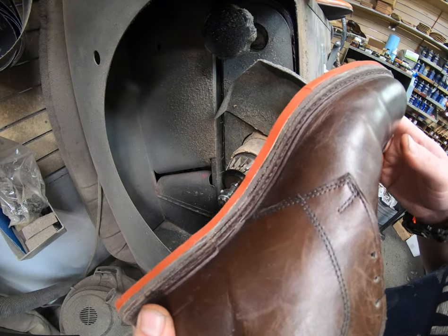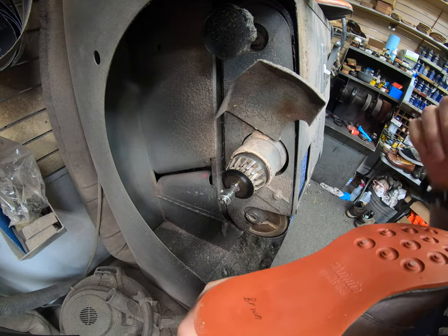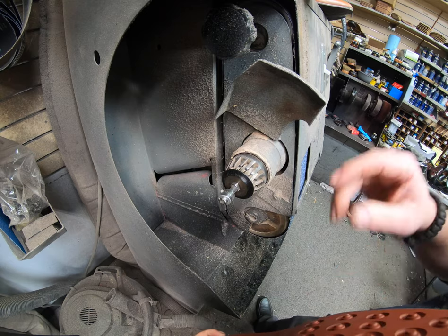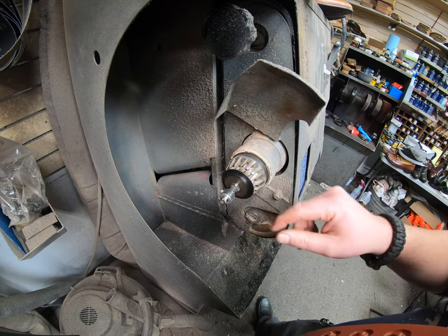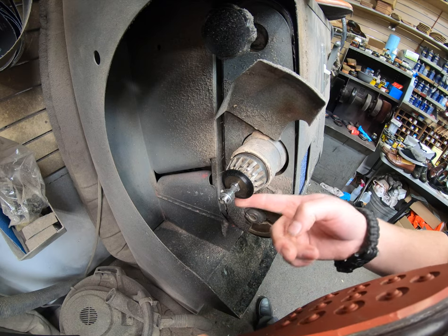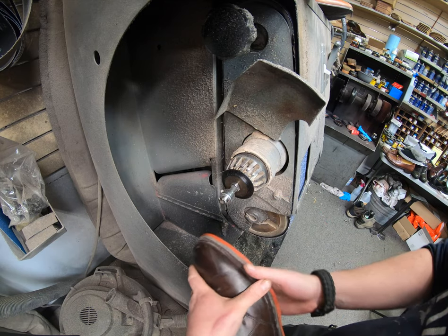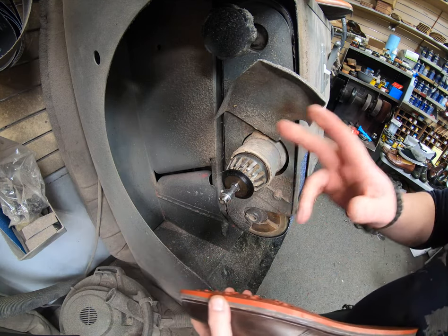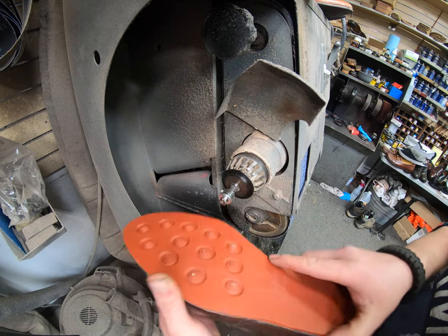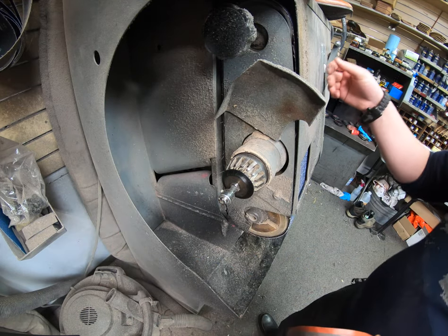All right, so we're back here again to get these all sanded out around the edges and get the channel grooved. Did get the heels in, so gotta go ahead and get them taken care of quickly. So I thought I'd change up the angle, see if this might be good for you guys to see how we do the channeling. We've got our sanding belt down here. There's a groove right here, but we don't tend to use that too much with rubber soles, just because it's basically a blade that spins really fast and it tends to really grab hold of that, and will just yank the shoe out of my hand. So we're not going to be using that. We tend to use that just on leather and certain types of rubber materials. And then the groover will have to channel out the area where the stitch will be sitting down in there. All right, so let's go ahead and get started.